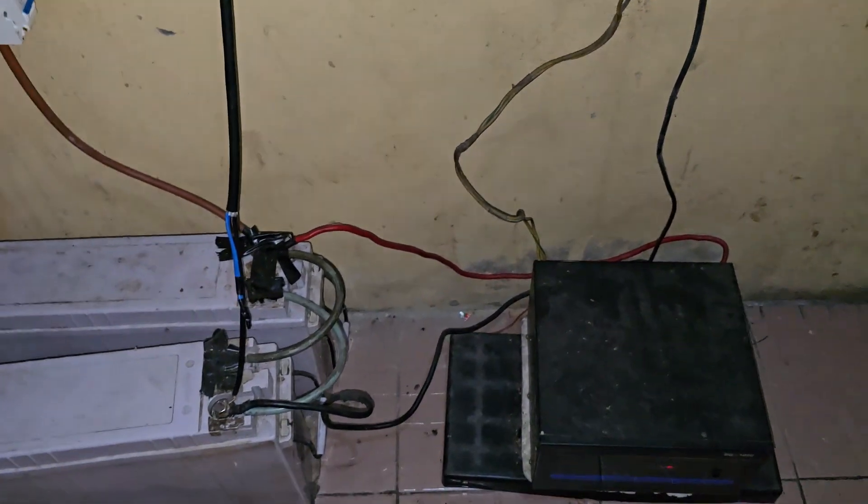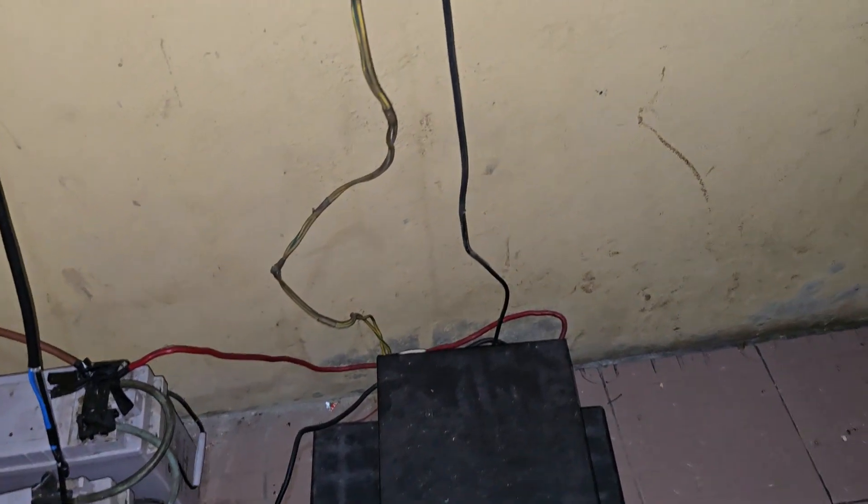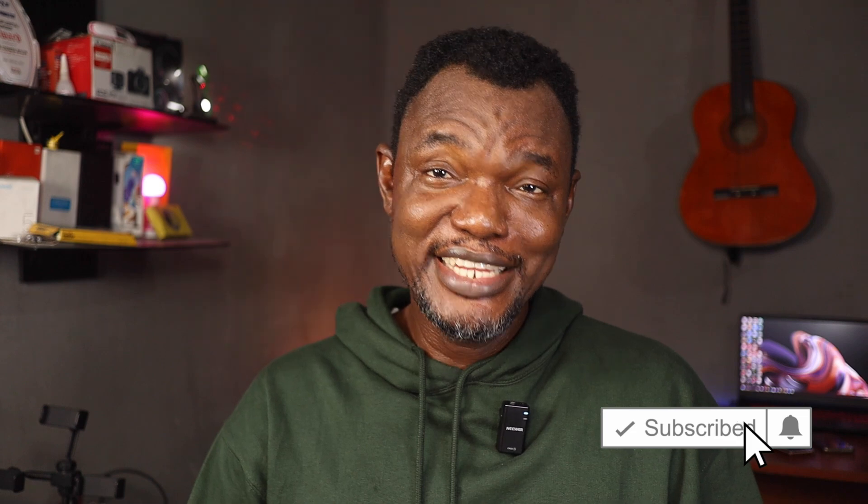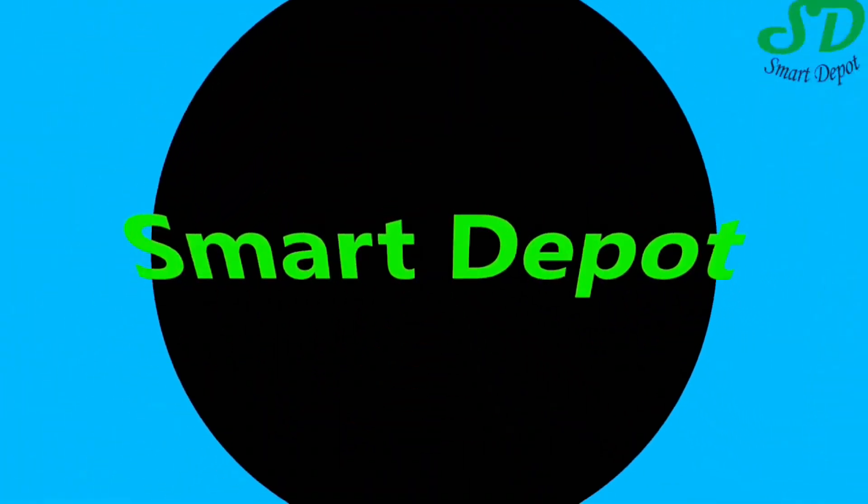The reason why you might not want to run a fridge on a 1kVA inverter is because of your battery banks. I have two 150Ah batteries here that may carry this fridge for five, six, or seven hours with maybe a few other loads. But because I have a solar panel connected to it, I can leave it on for five or six hours during the daytime if there is sun, and it will be just fine. So to answer the question: yes, your 1kVA inverter can carry a fridge, even up to this size — but it also depends on whether it has good surge power and whether the starting current of the fridge is not way beyond what it can handle. Let me hear from you in the comments. Make sure you like, share, subscribe and follow me for more. Until I see you in the next one, it is peace to our world.